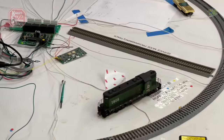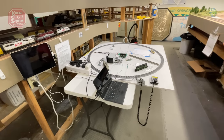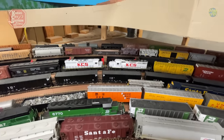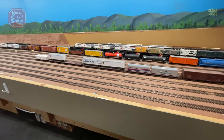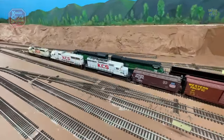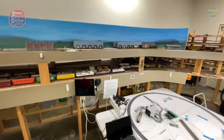If all locomotives are on the front end of the train, it's not a great big deal, but we have several longer trains with distributed power, where we have locomotives in the middle of the train, and if those locomotives aren't running the same speed as the locomotives at the front of the train, you have train handling issues. If the middle units are pushing too hard, especially in curves, it'll cause the train to derail, typically to the outside. If they're acting as a brake and not running as fast, creating tension in the train, it'll pull the train off on the inside.